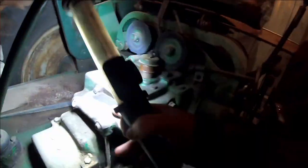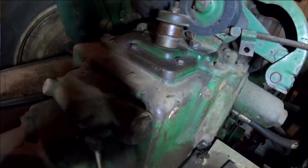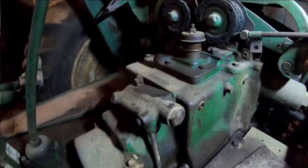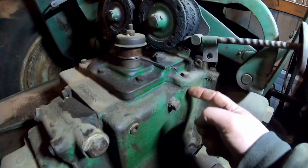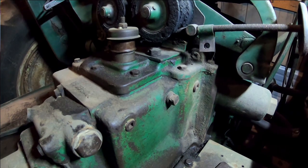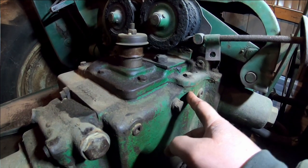So to add power beyond, you're going to have to take off this priority valve because there's a plug right there. I'll go over to the 1900 — it'll show it better. That's an A series. There's a bolt up here and a bolt down here on this priority valve. Move it out of the way so you can get this pipe plug out, and then right about here is some 3/8 threads between these two ports, but it's on the inside — you stick it way back in there. So you're going to have to have a long driver and an allen socket type 3/8 pipe plug, something where you can reach all the way back there and thread it in.